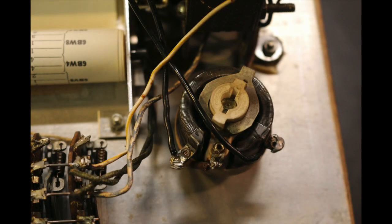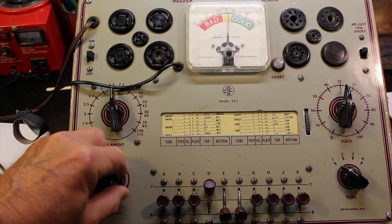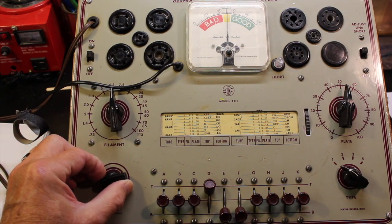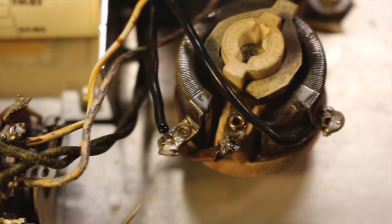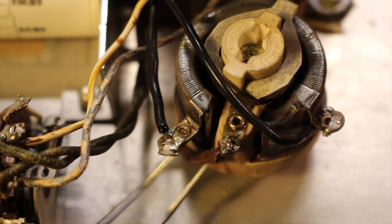Here is the line adjustment potentiometer — it's actually a 10-watt rheostat. You don't see those anymore. It's to adjust and make sure the voltages being passed around in the circuit are appropriate for the line voltage, so you center the meter using this rheostat. Trouble is, with modern voltages — this thing was built when voltages were somewhere between 110 and 115 volts — right now in my house I get 123 or 124 with no problem. So you have to turn the rheostat all the way down and it doesn't quite center anymore, but that's probably okay. On close examination I did find a cold joint on the rheostat, which is easy to repair, and it was the only one. Otherwise it was a well-built kit.